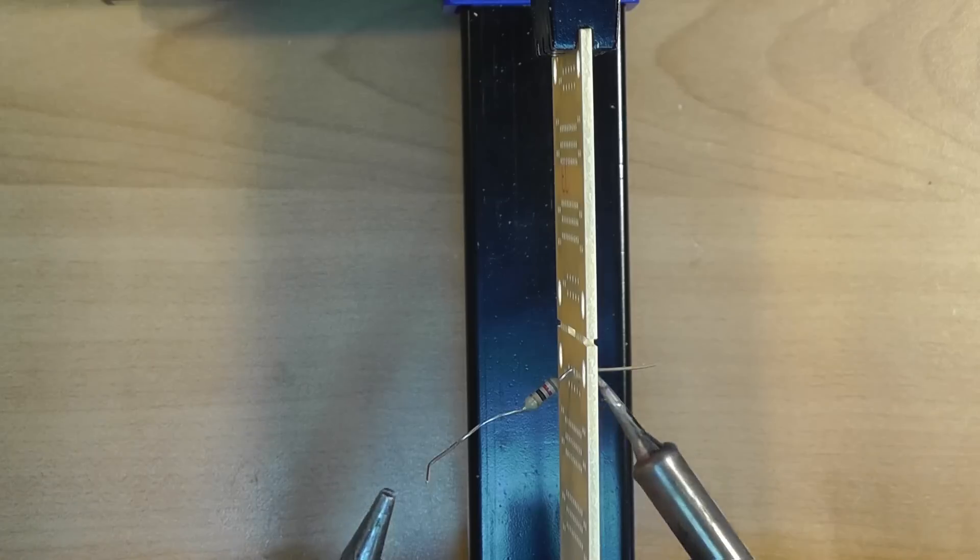That's a super high-level overview of how to solder. Why might we need to desolder? A favorite mistake of mine — judged by its frequency rather than desirability — is putting the wrong part in the wrong holes. To proceed, I must remove the solder sufficiently to remove the part, then get the solder out of the hole so I can insert a new part. If it's a part with leads I can grab onto, I can simply heat one lead at a time while physically pulling on the lead from the other side, then doing the same with the other lead. This usually leaves the hole full of solder. If the leads on the new part have enough strength, I can, one at a time, insert the lead while heating the joint and pushing it through, using a holding tool since the part gets hot fast. If that doesn't work, we must proceed to actually desolder the joint.